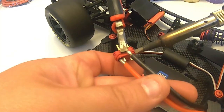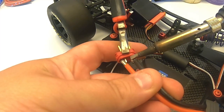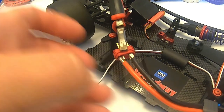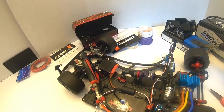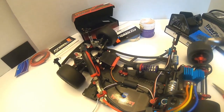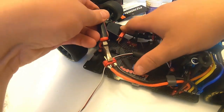I'm going to get my pliers repositioned and then we're going to go in and do the same thing again — touch both sides just for a second, get that wire lined up where I want it, press down gently without a lot of pressure, and you can see that solder settle and move. And then boom, it's done again — it's as simple as that. Now I'm going to show you how I clean up the soldering bit: I wipe it on my sponge, dip it in some flux, and clean it off on the sponge again. It just cleans up the solder head and gets it ready for next time.